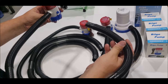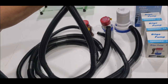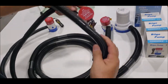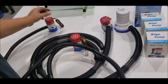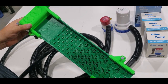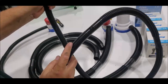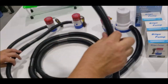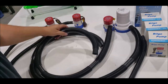When we give you three foot of hose for this pump, we're saying that's the limit — you're not getting more than three foot of performance out of it. When we sell you a 750 pump, we'll give you five foot of hose, because we know if you're dropping five foot it's going to help you run the micro banker or the little cleanup sluice at about 500 GPH — even though it's a 750, that's all it's going to deliver. At the same level though, it'll pump pretty well. We're trying to help you understand your pump sizes.